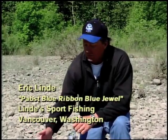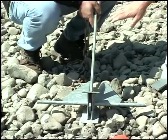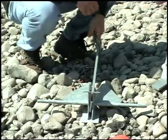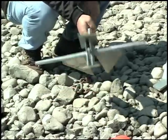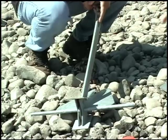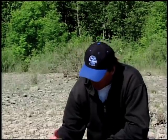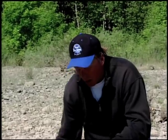That's a 13 pound version. They're lightweight, but they've got a lot of holding power because those flukes dig into the sand and then the tine lays flat on the top of the sand and the chain holds it down. When you get up into rocks, it just can't dig in through the rocks. I see a lot of people in the upper river trying to anchor with these and it's just sheer luck that it catches or lodges. What you really need up in the upper water where you have a rock bottom is what they call a rocking chair anchor.